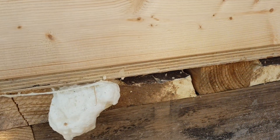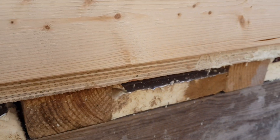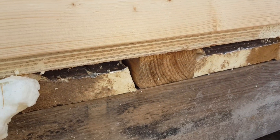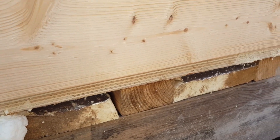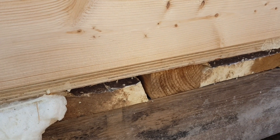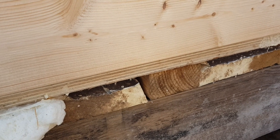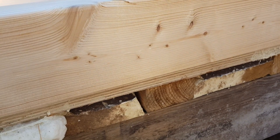I've also put insulation under the floor — a big piece running across and little pieces in between all of the three-by-twos to give pretty good insulation in the floor. You're going to need to keep this room fairly warm and above zero at all times, otherwise the batteries aren't going to work. So we'll probably end up putting a heater in here, but the equipment itself might keep it warm enough if we insulate it right.